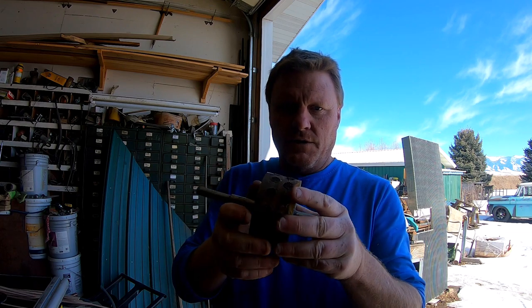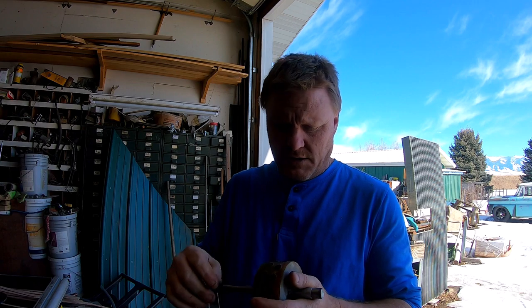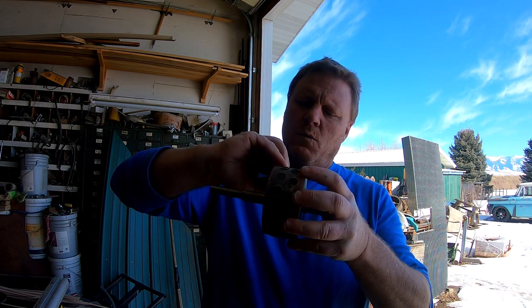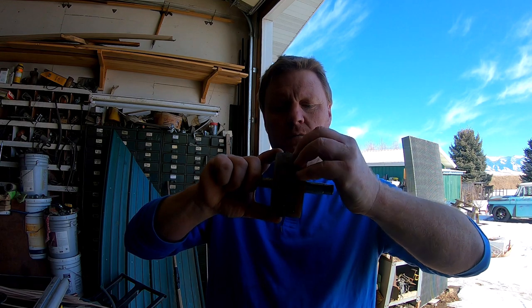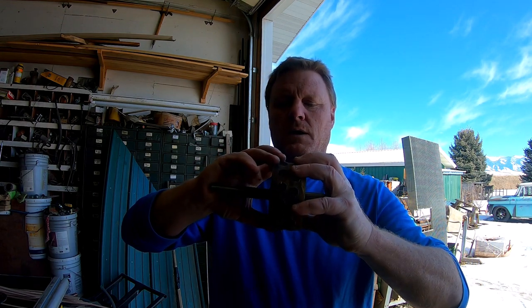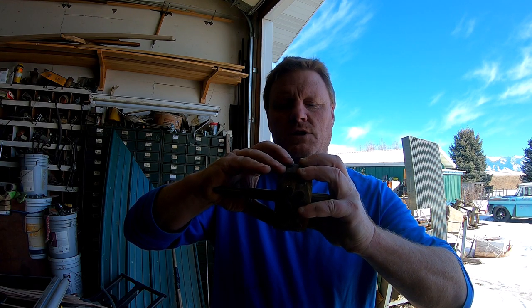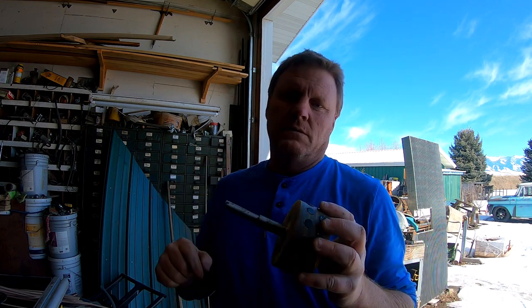What I'd like to do in the future — and maybe we'll make a video about that, which is why you need to subscribe to my channel — is I'd like to make this rotor in two halves, each half with magnets set in resin, and make it so the two halves can turn relative to each other. That way we can get the offset adjustment perfect, with as little cogging as possible.